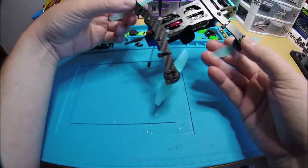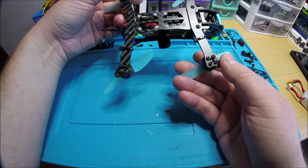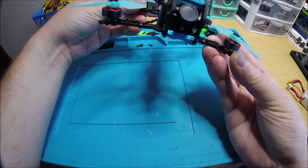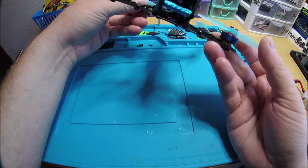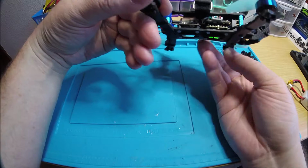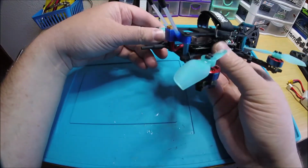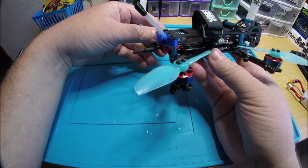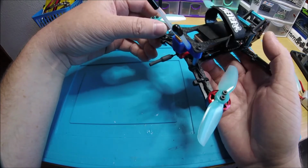I know that instead of having slots, it just has holes for the motors because it only fits the 9x9 hole pattern, which these 1404s use. So you have the Airblade Superman motors, the 1404 3850 kV. You have the Speedix 20 amp 4-in-1 and the Omnibus F4 V6 flight controller. You have the AKK FX3 or FX2? FX3 Ultimate. And the HGLRC GPS.